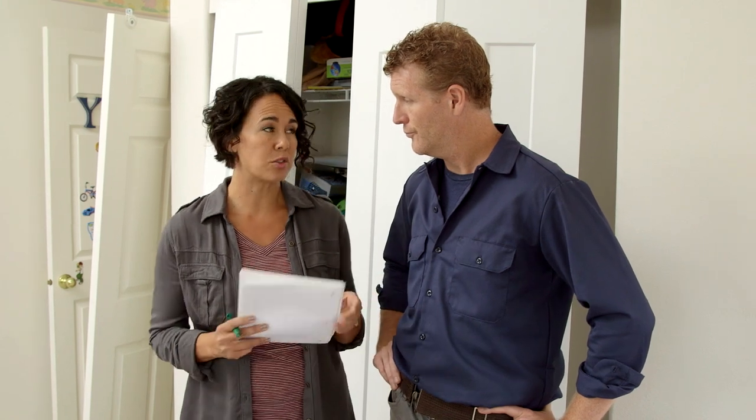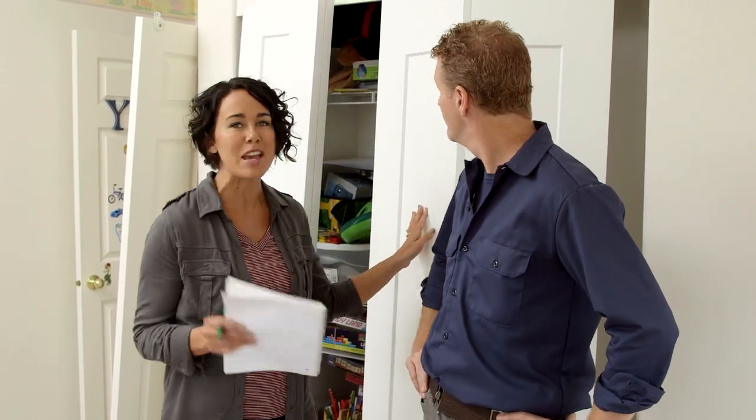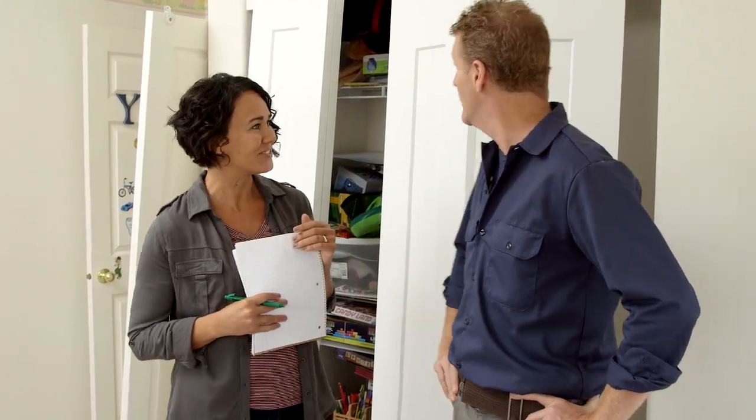Well, that's it. But remember, when you receive your bifold doors, they're gonna come with the measurements that you took, not the actual measurements of the door. That's to leave room for the hardware and to allow an even gap around the entire door. These Jeldwin bifold doors are perfect for tight spaces, and because they come with such a variety of styles, it makes it really easy to coordinate your bifold doors with just about any door in your house. I can't wait to get started. Let's do it.